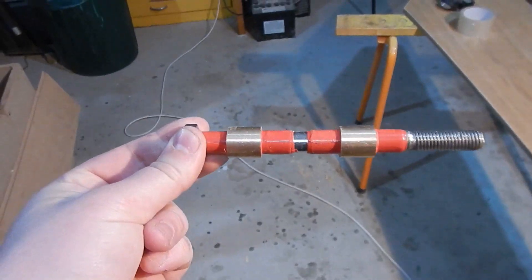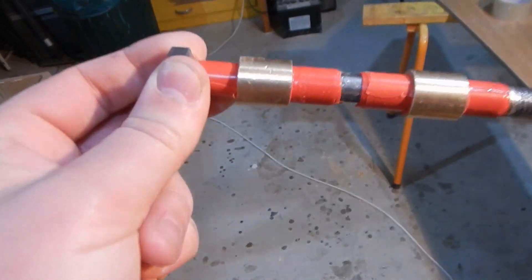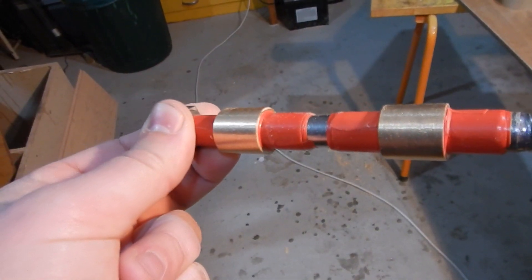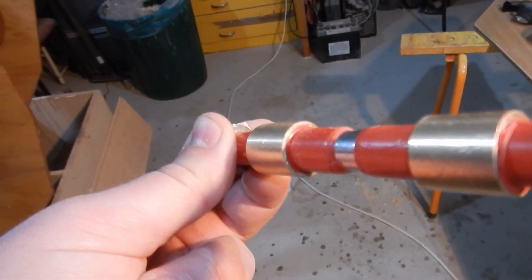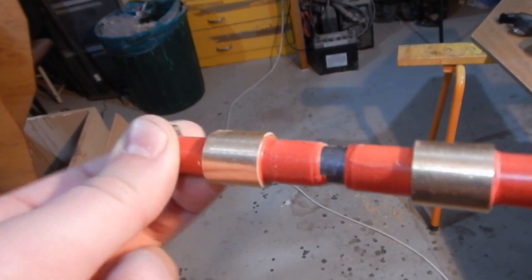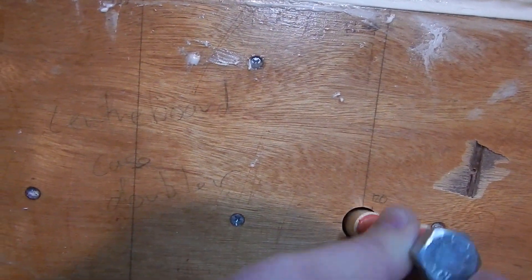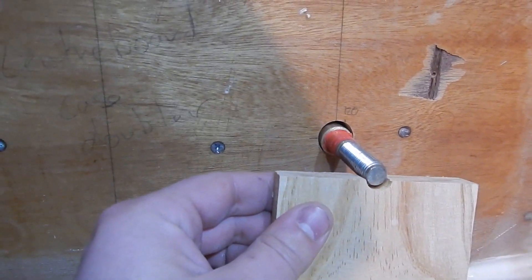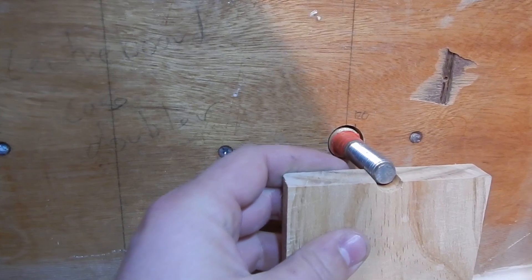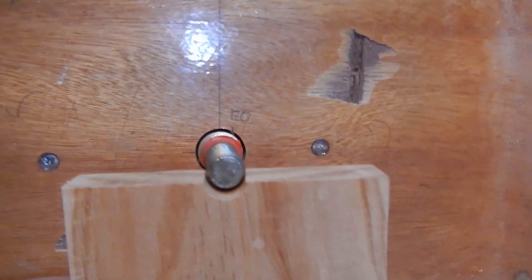Here's the system I got: I've got the two bushings spaced out on this bolt exactly in the right place they need to be, and I've got tape holding them in on both sides so they're not going anywhere. The tape will also stop the epoxy from going in underneath between the bushings and the bolt. I also need to make sure it is centered in this hole — you can see it's oversized. I've made up two little bits of wood that suspend the bolt exactly in the center.